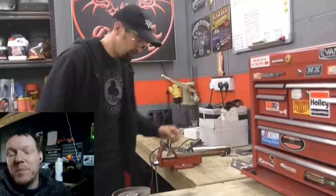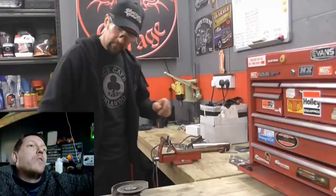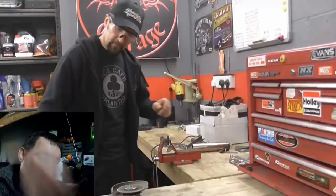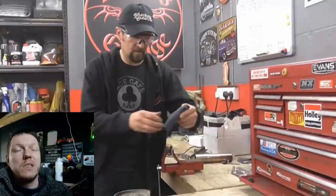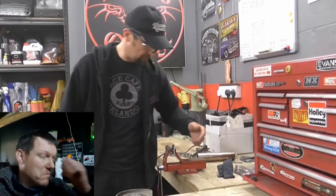What a job that was. Matt observes that some people are so brutal with angle grinders — especially cutting discs — you can see puffs of dirty smoke and dust, basically the disc just disintegrating because you go way too hard with it. Just let the grinder do the work. It took about two seconds to literally just slice straight through that piece of 2mm steel.